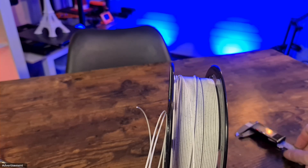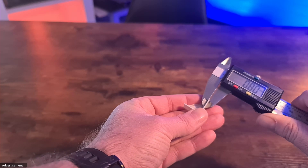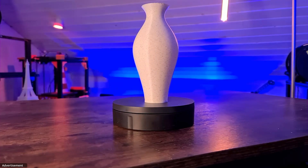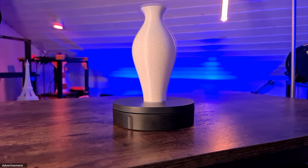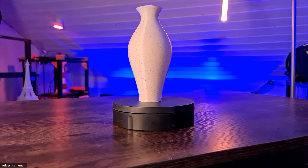So I made a flow calibration part, printed it out, and changed the flow parameters based on the measurements inside Klipper. I then chose a spiraled M4 as my next print. And look at this beautiful surface — now the layers are much nicer, and this marble look is really amazing. I absolutely love that. Beautiful. This is why I like to test marble PLA, because of this beautiful classic look of elements you can print.